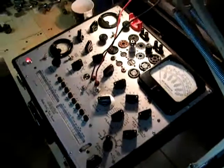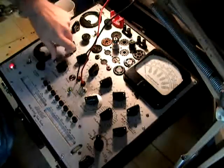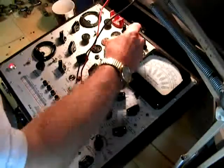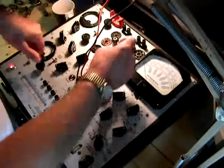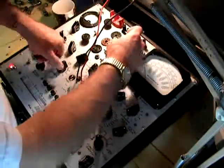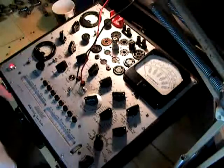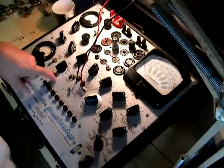It's imperative to do these noise tests for amp tubes because if they're noisy, it can cause problems. We're going to make the switch run through positions 5 through 1 and tap the tube at each station. There's 5 — give it a tap, listen for noise. There's C short light. There's 4 — that's good. There's 3 — I heard just a little bit of pop, but nothing to declare problems. Now that little blip of light you see going from one number to another is the capacitor discharging — that's normal, not to worry about. But if the light stays on, we've got a short and a problem. The tube is clear of shorts on cathode 1 — this is a double cathode tube, so we've got to check both.